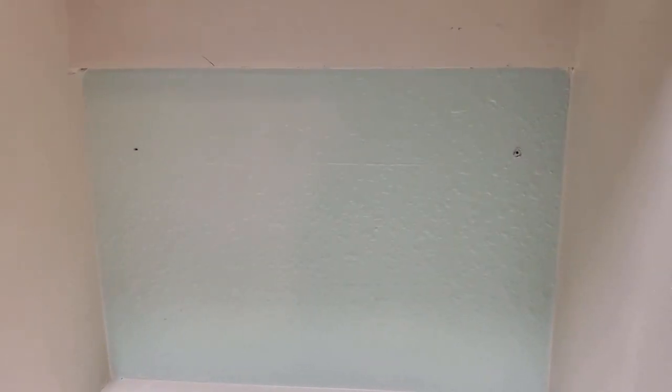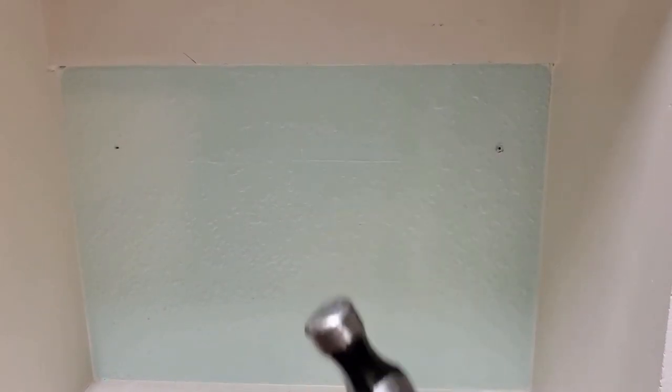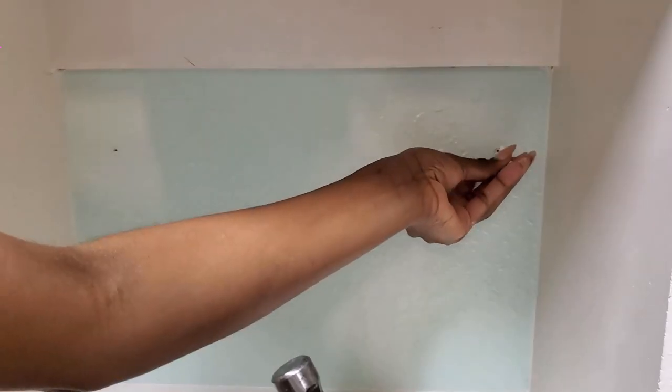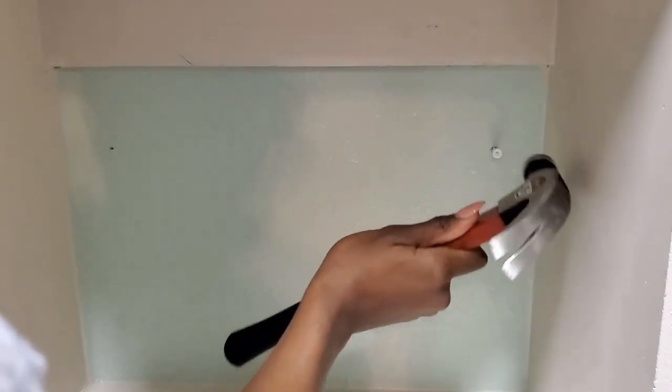I'm back out again. You can see both of my holes. Don't touch, Raven. I'm going to take my anchors, and you will also need a hammer. I did not say that, but you need a hammer. What you're going to do is put this up to where you drilled that hole and hammer that right on it.